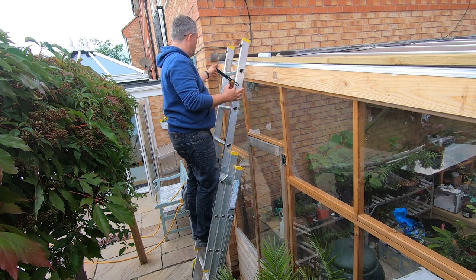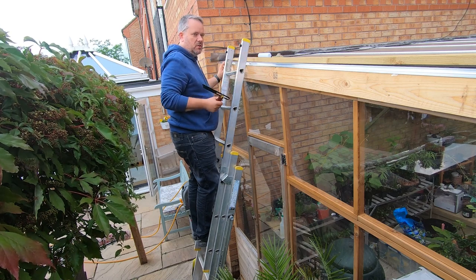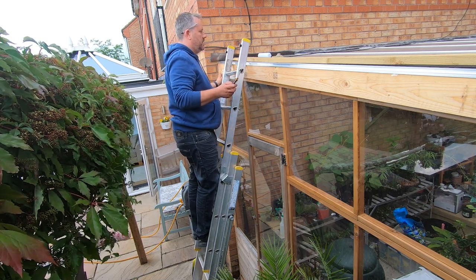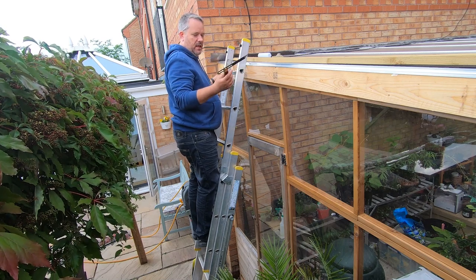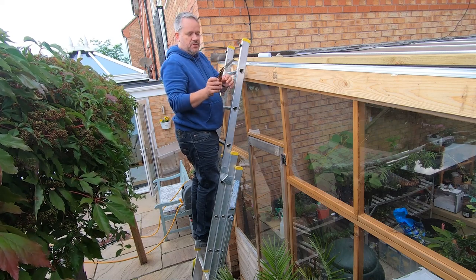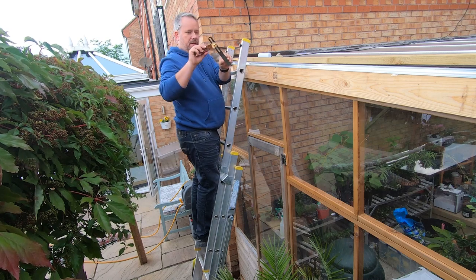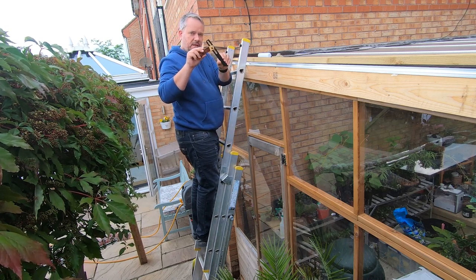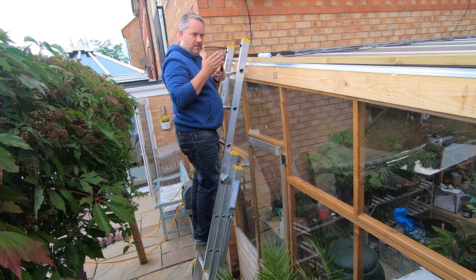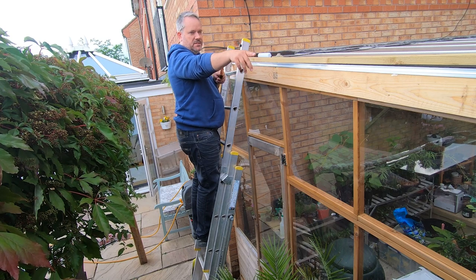The first thing I'm going to do is work out this angle down this side. It's not a 90 degree angle so I can't cut a 90 degree angle to put it up nice and flush. What I've got is a joiner's bevel with a nice rosewood handle, made by Stanley - it's a nice piece of kit. We're going to use this to go along the straight edge at the top, and moving this angle we can determine how much to cut off the timber.